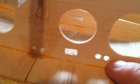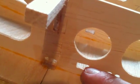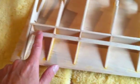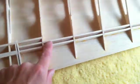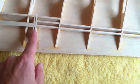One of the steps I did previously was drilling holes down here — these are for the airlines to get adequate room to run them through, and this is for the servo wires and their jacks to provide clearance to run those through the wing. We will be installing flaps here, and as you can see this has already been set up for the flap. We'll be eventually cutting that off to make our flap, and over here will be the aileron running along the whole length of the wing from the flap to the wing tip.